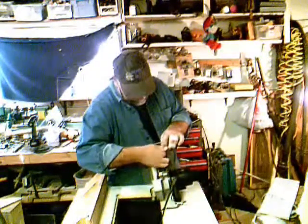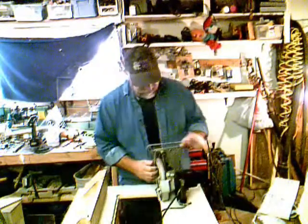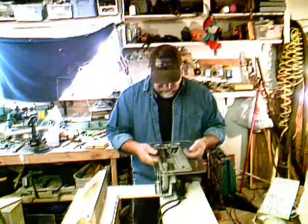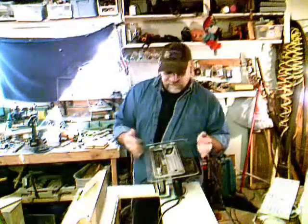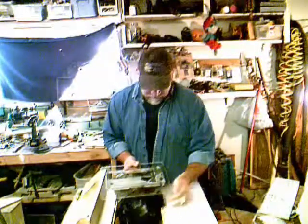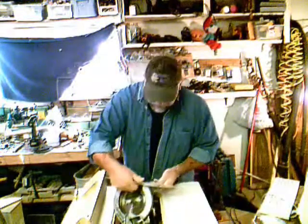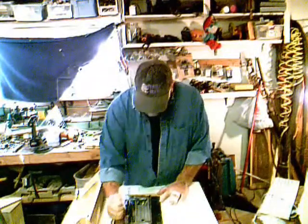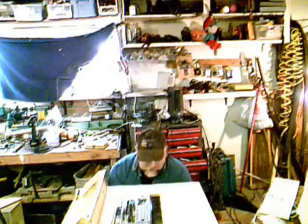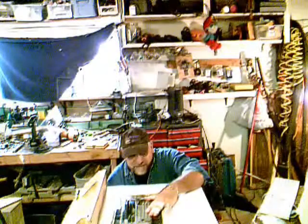Keep that in mind — if you're going to use this as a utility table with a tool installed, you should go with the router because you can pull the router all the way down or pull the bits all the way out. It's a lot easier than trying to pull a saw blade out. I've got the three screws mounted in and haven't tightened them all the way because I've got to square the blade to the table first.